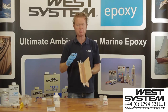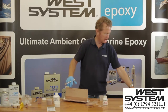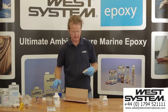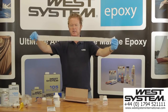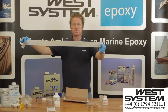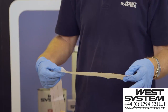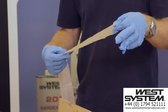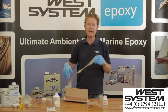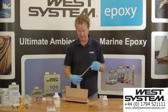There is a much, much better way of ensuring a sanded finish here, and that is to use this material, which is called Peel Ply. Peel Ply is a nylon fabric that doesn't stick to the epoxy. In fact, when the epoxy is cured, you can rip this away. That's the whole intention of using Peel Ply, is that you can rip it away from an epoxy coated surface. And underneath this, you will be left with a negative copy of the impression of the Peel Ply. And that is as good as sanding. It's like peaks and troughs, peaks and troughs. It's actually graded, so it's better than sanding.